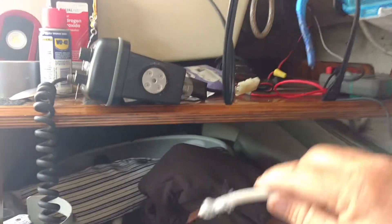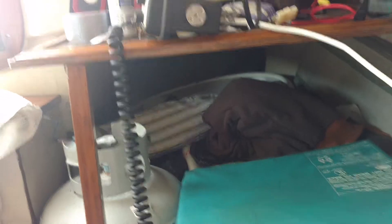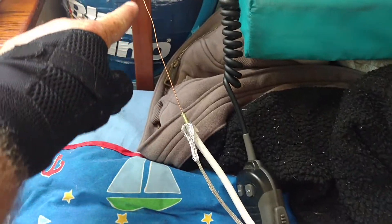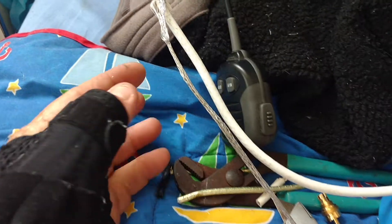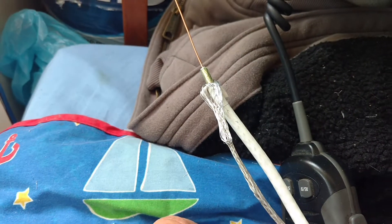I have it on the weather channel right now and it's on, so we should be hearing weather coming out of the VHF, but we're not. So let's plug this in and see what happens. Look at that! This is now a VHF antenna — this straight wire. So you take this TV coaxial cable, separate the shielding, expose the copper, and boom — you've got an emergency VHF radio antenna. I did a radio check and got a response right away, loud and clear.